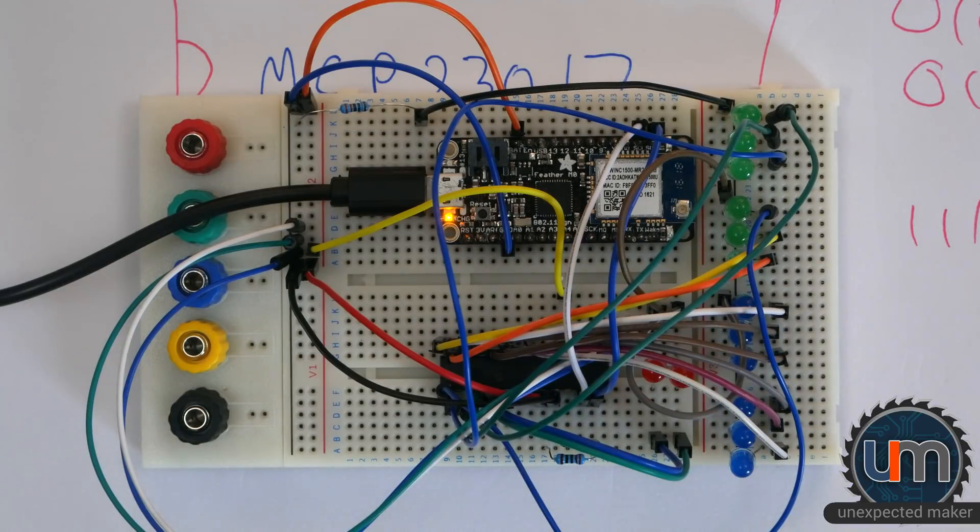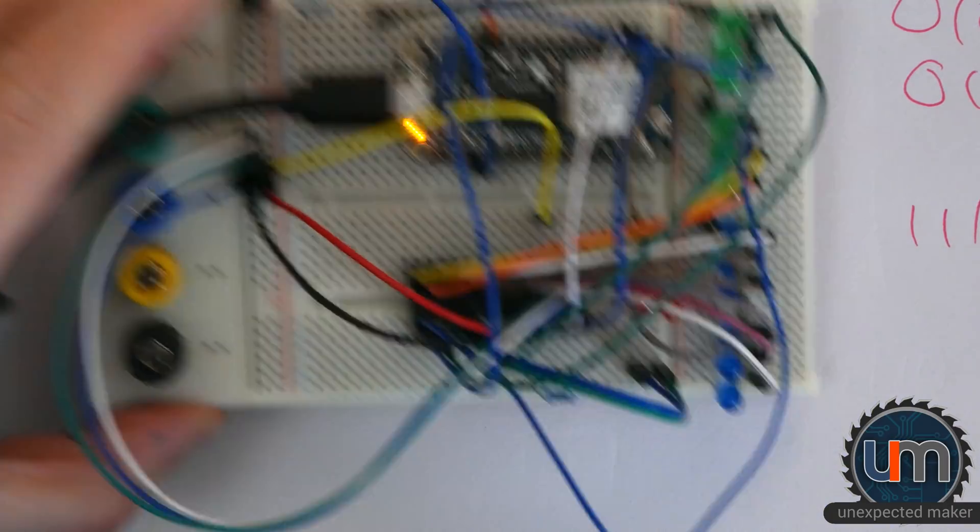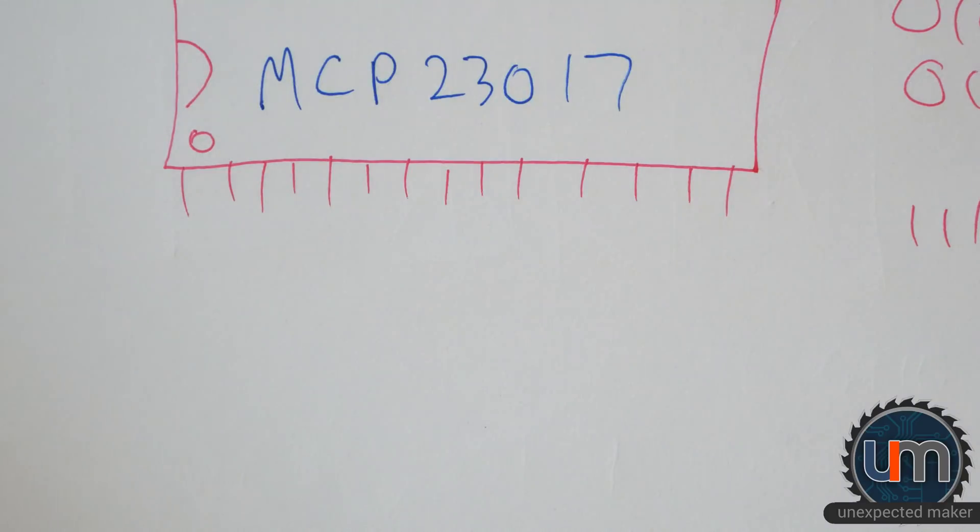So I'm going to go this way, because it makes building a library very easy. It means I can control the brightness of each filament individually or as a whole, and do effects like make them flicker. I still have to decide if I'm going to be raising the filaments off the board or not. I haven't gone into the design phase of the PCB yet because I wanted to solve what I was going to do for an IC, and I have done that. It's a rather long chip — 14 pins on each side — but it is a through-hole chip, which is great. So it'll stick with the whole retro theme.